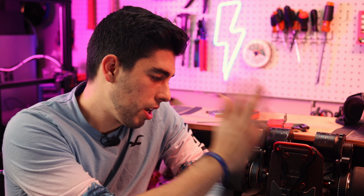Alright, so this is a point of the build where I kind of ran into an issue that took a long time to solve. So if you noticed, I said that I was trying to figure out how the switch was working and if I was going to be able to get a replacement. Well, I bought some replacements on AliExpress, waited for them to deliver, and they came, and unfortunately they weren't the right spec exactly. Basically, the FlipSky Anti-Spark uses a 5-pin switch with a normally open and a normally closed pin, and it uses both of those pins to turn on and off the anti-spark switch.